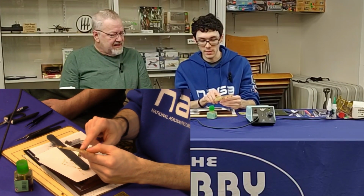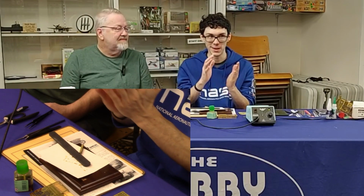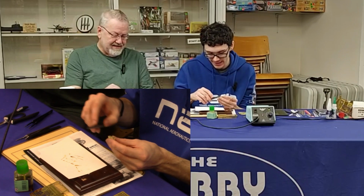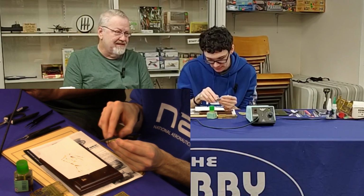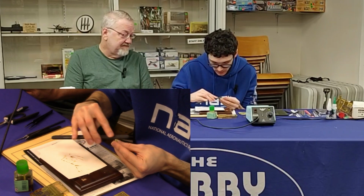When you were doing this, I was thinking you would be able to roll this and it wouldn't separate. That's correct. Because when you do the two individual parts and try to roll them and then sear them together, they're never at the same. They never hit. And if you glue them, you can't roll them, because of that thickness of glue, which doesn't seem like much until the pieces separate and you see how much glue residue there is. But on here, you're looking at microns.